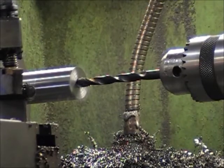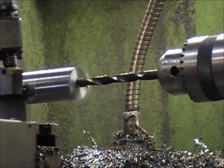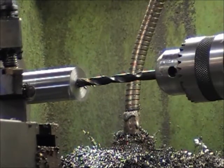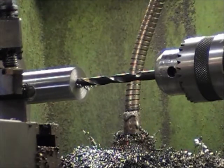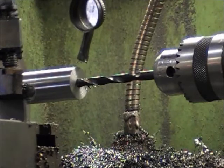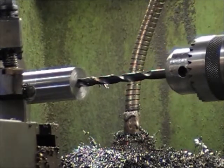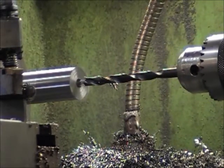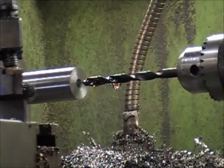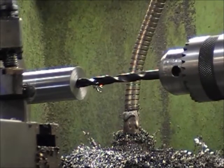We'll use a little cutting oil on it. A lot of guys use engine oil and what not, and really it's not a good idea. It's better than nothing for sure, but it has no sulfur or anything mixed with it. The oil will act more as a lubricant than a cutting agent.